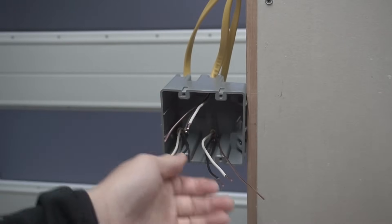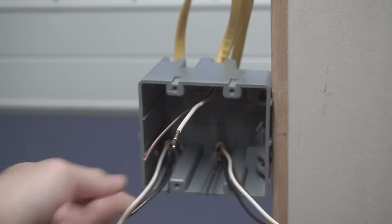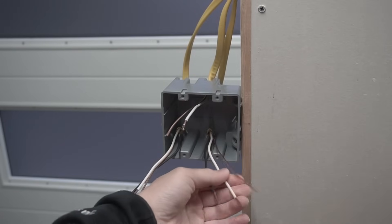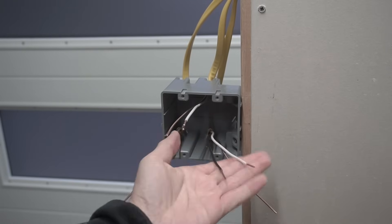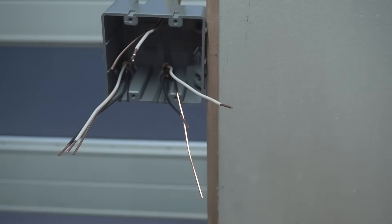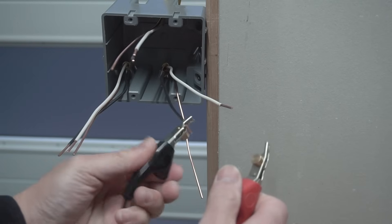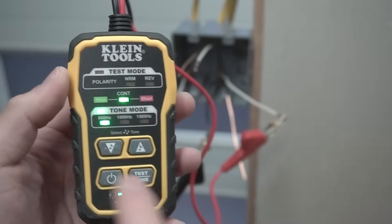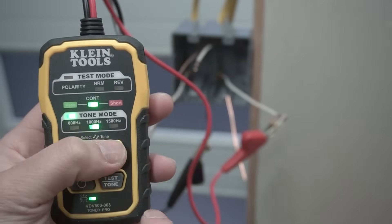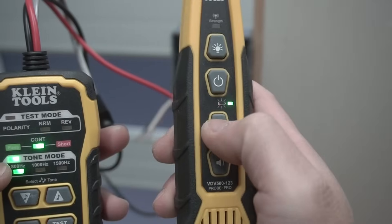Try to group all the wires to their respective cables. If you can see the sleeve where they're going, that's even better — you know how they're grouped, and that's half the battle. We're mostly going to work with the hot and the neutral, not the ground. Separate them at least two inches apart. Attach the red or black clip to the bare wire, then turn on the device. Once it shows continuity and it's green, you're ready to go. It defaults to 800 Hz but you can scroll and pick a different tone. You can also control the volume levels.